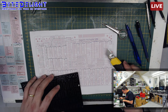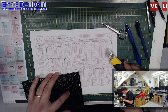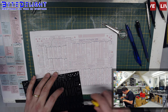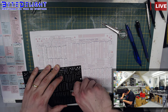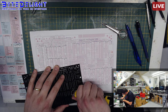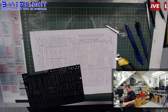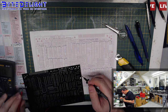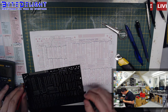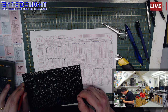Okay, so the connection was on the bottom, and that's where we are here from the second chip. So it's the one going down here. This is a clear, very simple and clear cut here. I know it's kind of destructive, but we can fix it easily later on. So we have just removed 5 volts, and that's something we're going to measure. So there's no more 5 volts going from the regulator here to that part. So it's here and it's not here. So we did a good cut, nothing wrong with that.